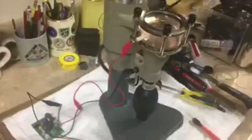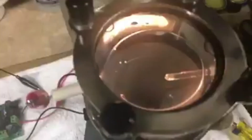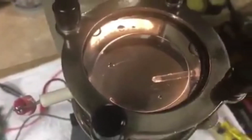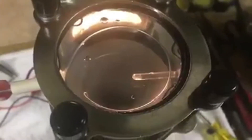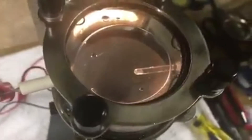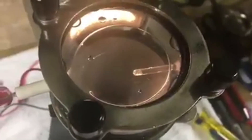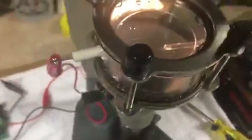In this whole section from about the bottom of the bulb all the way to just below — probably about three, maybe four millimeters — just below the probe you see there, that glass stick: on the end of the stick is a small amount of radium, and that will be the source of the alpha particles.